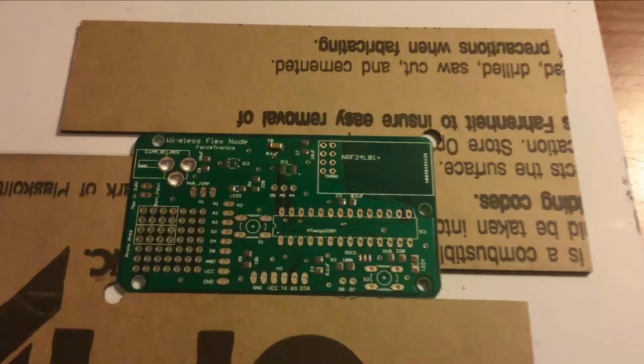Here's a better view of the final result — you can see the solder paste on the pads. Here are the oscillator pads; they're pretty small, which is one of the areas the stencil really helps. You can also get a closer look at the jig. If you're doing this in mass quantities, you can buy a much larger amount of solder paste, put it in a Tupperware dish, dip your card in, and spread it on — that's the approach for higher volume.